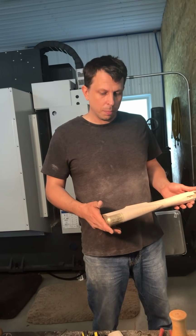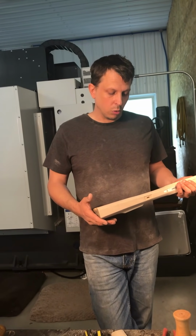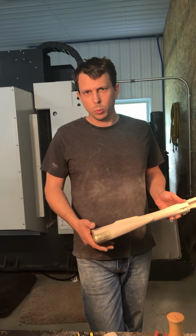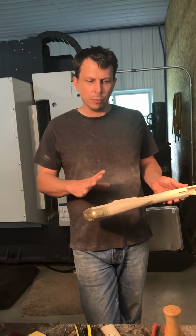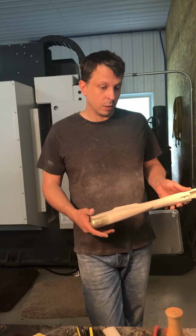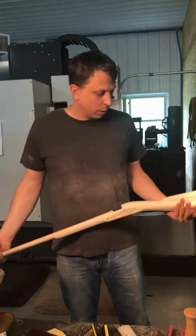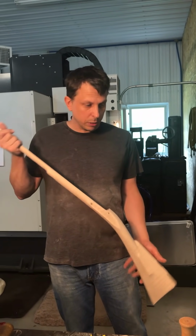One of the big advantages of scraping is it can give a texture to the surface, or it creates a surface that has a different appearance than a sanded surface, which can add a lot of interest. In one way, the surface will be less perfect, but the fact that it's less perfect can add a lot of character to your work, and in a lot of ways, it's a nicer finish than sanded stock. So we'll talk about it a little bit. We won't go into great detail since we've already prepared this stock by sanding, but we will go over a little bit of information about scraping.